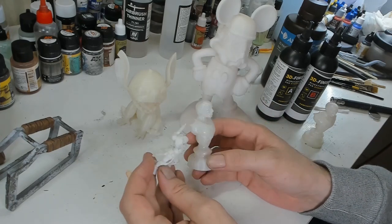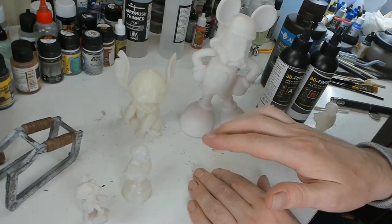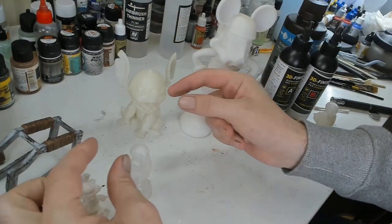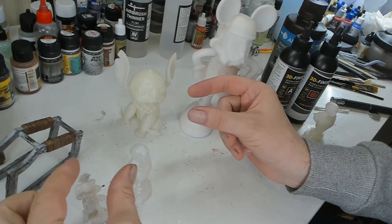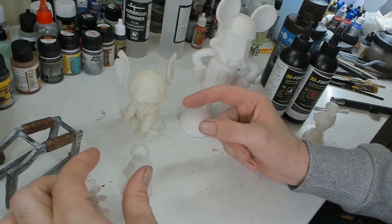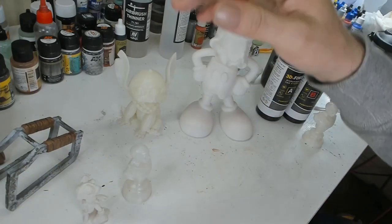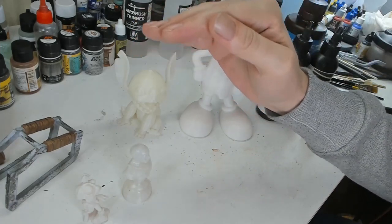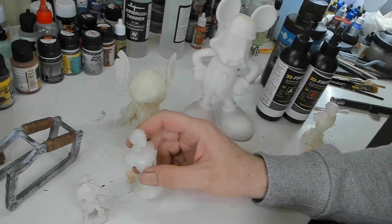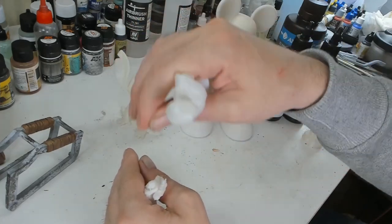What I mean by that is, once the printer had done the first layer, I would reach behind the printer and hold the two dials and twist them exactly the same amount. I'd just move my fingers like that. You get used to it quite quickly. It's one turn, then I'd move to the front and do the same. That would have dropped the print height by about a sheet of paper. That's going to stop some of the squishing effect when the layers are being laid.